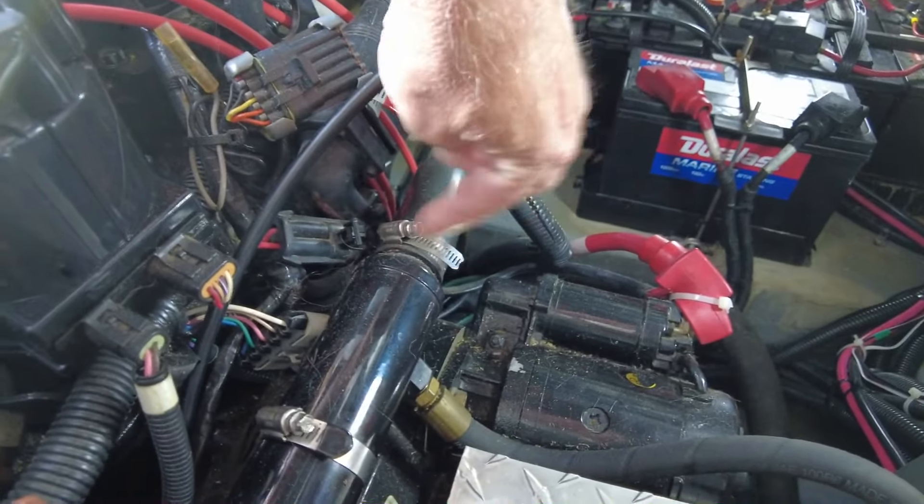Center line of the boat, right to the very back of the transom — those blue boxes are holding the float switches for these two bilge pumps. The two white items with white hoses are bilge pumps for back here. The aft-most one sits lower so it comes on first in a flooding situation. The other one's switch is set higher, so if it's a bad flooding situation — a hose comes off, whatever — it kicks on secondarily and hopefully saves the boat.